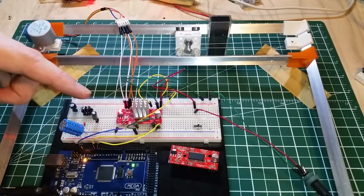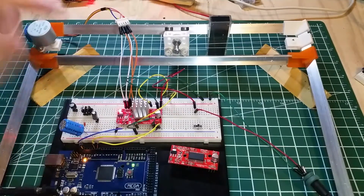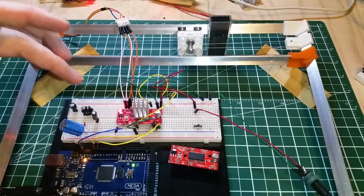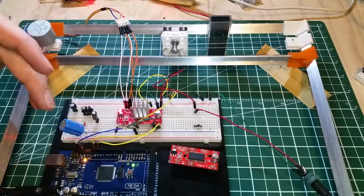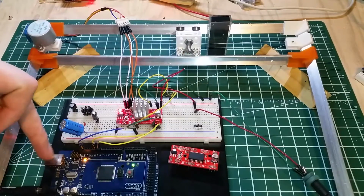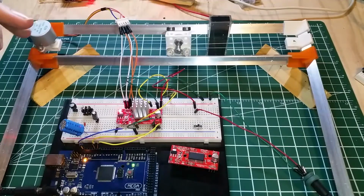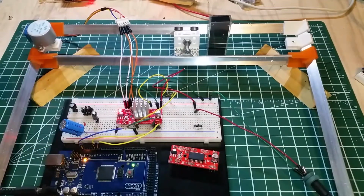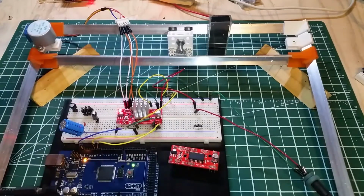It will most likely kill the driver chip. This IC will die. Those were new. I've since cleaned the oil off the tips. But what had happened is, when I was working on this, the USB cable that I had plugged in bumped one of the wires, and that, I guess, interrupted the connection just long enough to fry the Allegro, this IC.